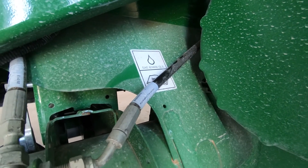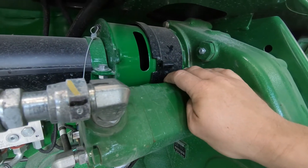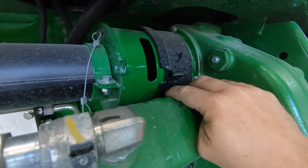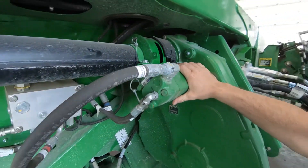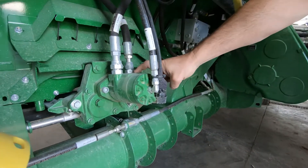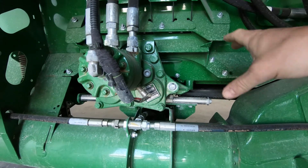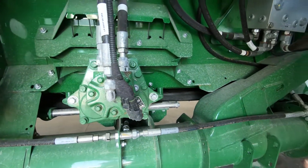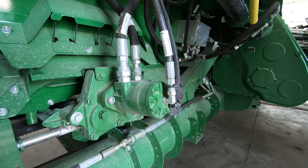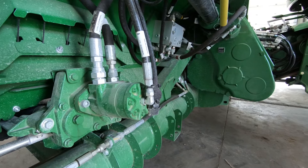It's pretty hard to mistake that. Up here we've got the radial pin slip clutches — make sure they're greased. If something gets under-greased, it will tend to slip more than if it's well greased. Over here we have the draper belt roller drive gear case. Make sure there are no leaks around it — it's non-serviceable and factory filled, so it's not intended to be changed or flushed. Just make sure there are no leaks anywhere.